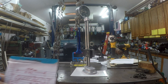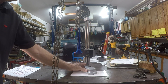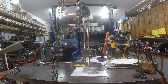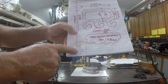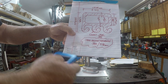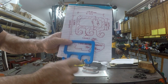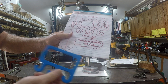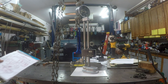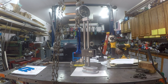It'll be interesting. Now the question is where will this unit fail? I brought out my height scale and I've taken measurements and written them down here on the bottom. I have the static measurements right now of what the top of the handle is, what the rail is, and the top of the hook. They're pretty much consistent within a couple thousandths. Let's put some pull on it and see what happens.